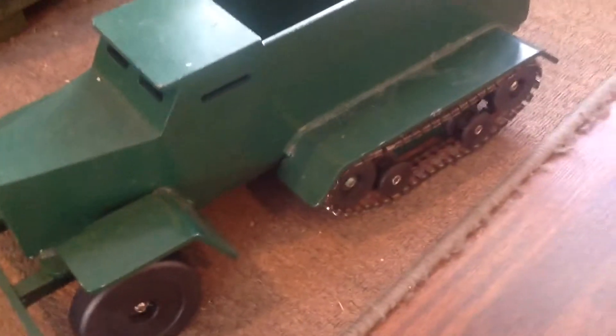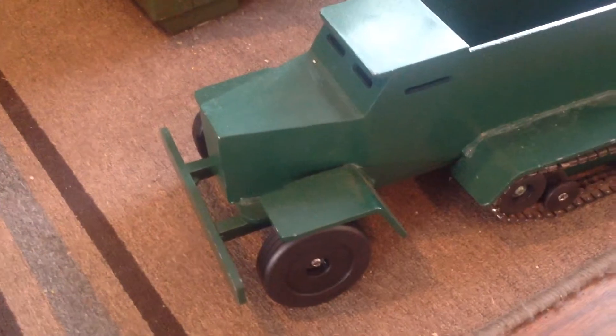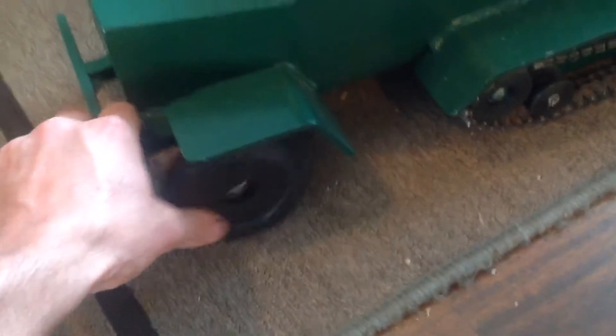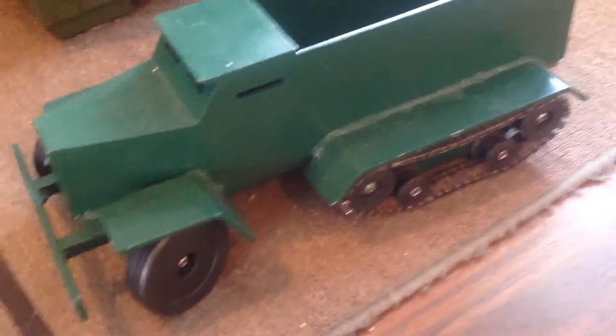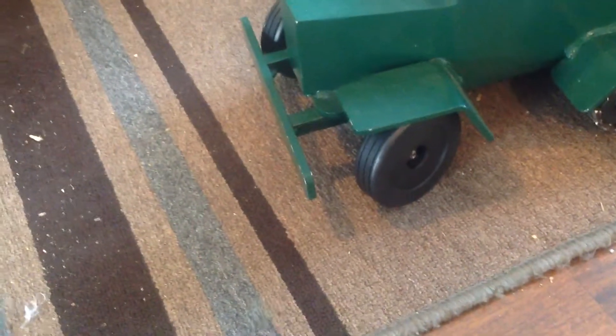The track is flat stock welded onto a K-attachment chain. The wheels are solid steel, and the rollers — I had them black oxided at a local machine shop. I know these guys and they let me throw them into a batch at no cost. Black oxide is way stronger and doesn't build tolerance — it just stains the metal black.